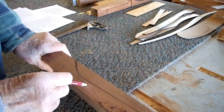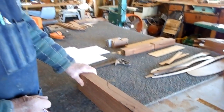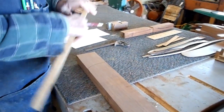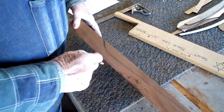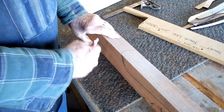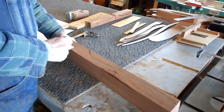This is another good fat part of the seat, closer to the middle. The reason I picked this spot is important, because what happens is the back leg of your seat will be cut out, and you'll have a big cut in like here. You don't want the dowel to be in this area so that it comes out inside of that cut on the outside board. So pick a fat area that's outside of that back leg cut area.